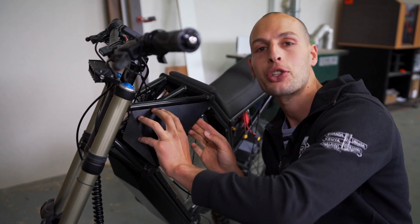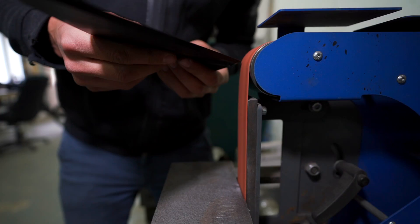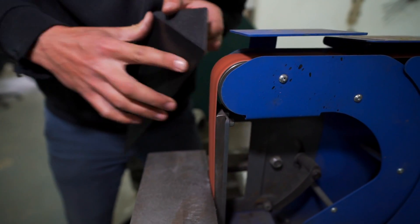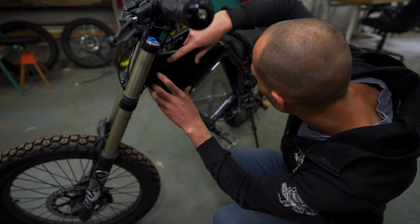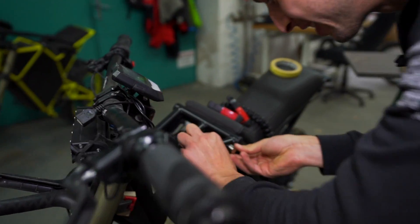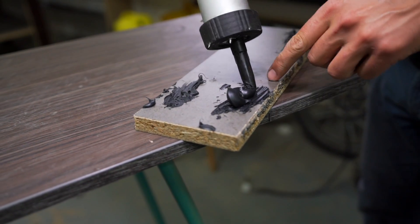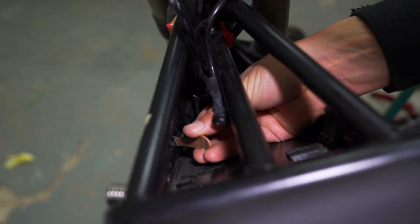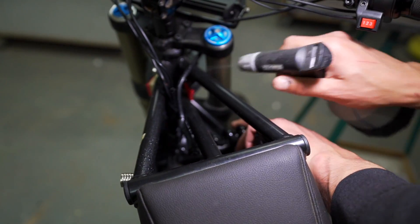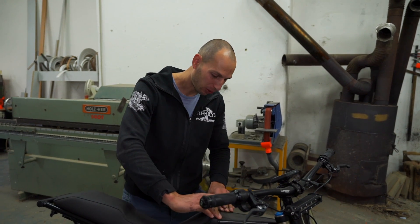Let's do the other side. Just like on the other side we need to make sure it fits — I'm usually looking at those welds and this edge. Now I just need to hold it in place. This is my favorite trick for these panels: if you have spare magnets, you just lock the panel in place by using magnets.